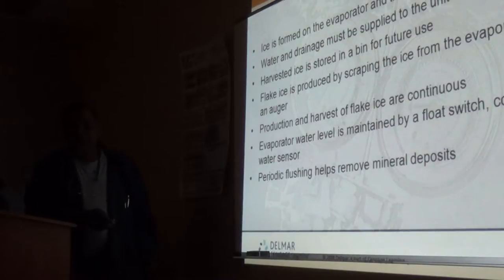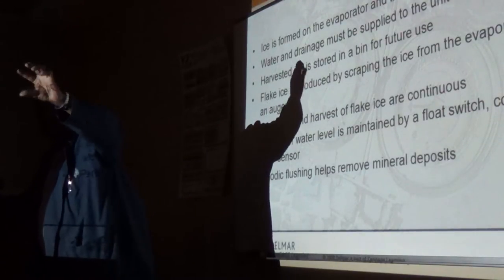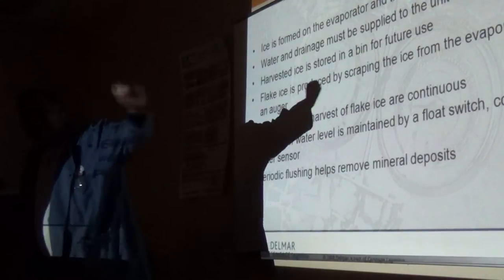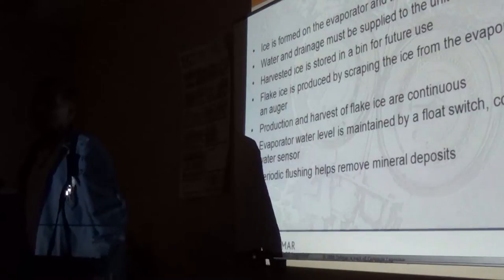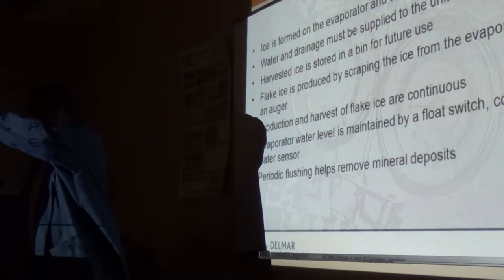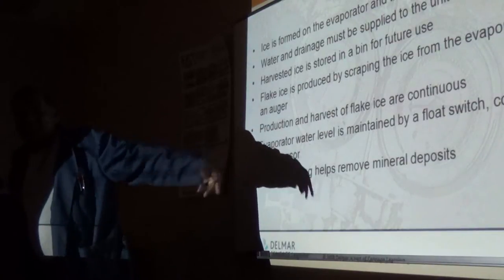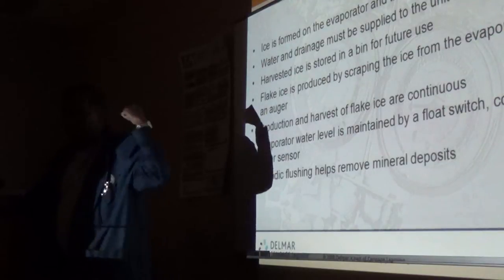So how would you test that? The water sensor? Well, if the water isn't coming in, or if it's overflowing, that's it. You can go to the board where it's plugged in and jumper the two terminals where the two wires go in. If the system works when you do that, it indicates the sensor is bad. That's the one advantage they give you.